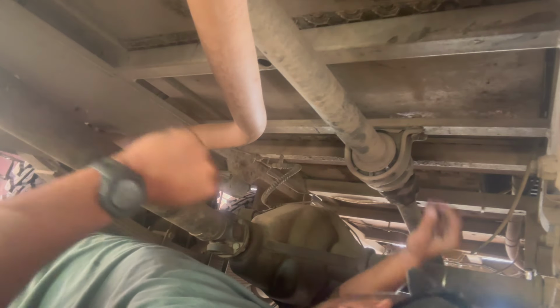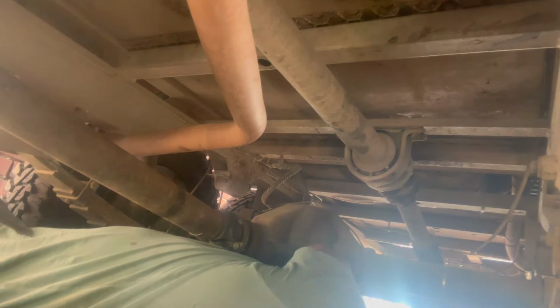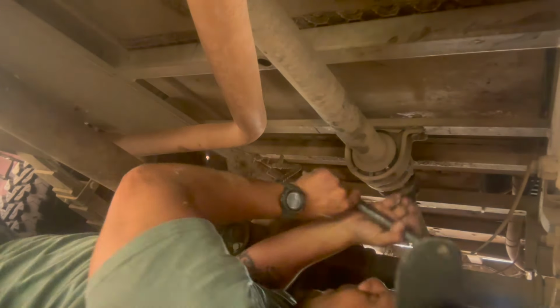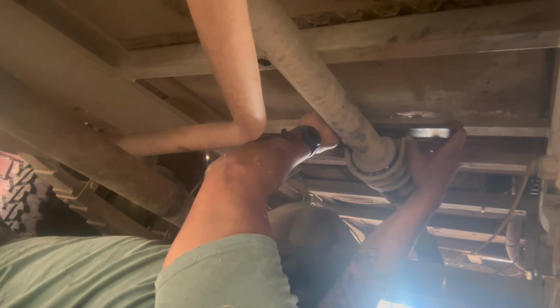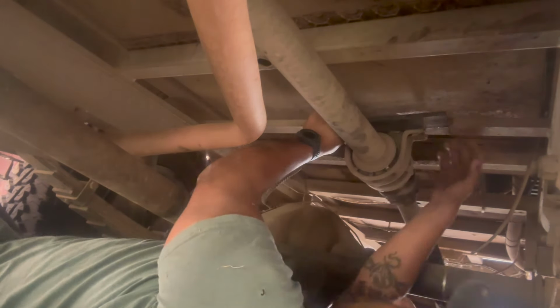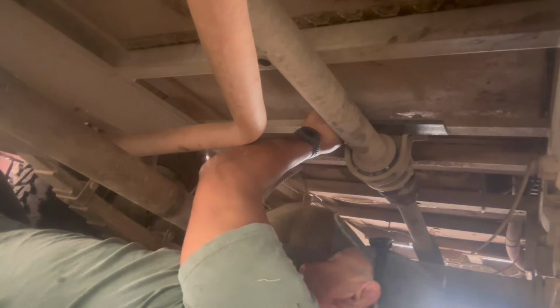So what I'm gonna do is take this off, and I have some 10 mil by 50 mil flat strap, and I'll drill some holes out and maybe put like an M12 40 mil, weld those flat into there so it adjusts, so I can adjust this center wheel bearing, and I'll drill some holes in there and then mount that to this cross member on the chassis.